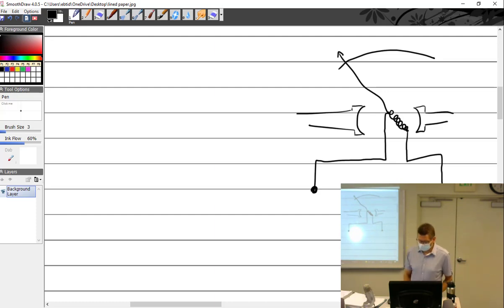Okay, so we have this meter here, and we talked about very small currents. It can handle it because the small current's going to come up through these wires, go through the movement right here, that coil, come back around. On this particular one, we said if we have up to about 10 milliamps, we'd get a full scale deflection to the right, and that would work. But for anything else higher than that, we had to have a what? A shunt, something in parallel. So our shunt, a shunt resistor that would take the rest of the current through it and leave just a little bit to go through that coil up there.